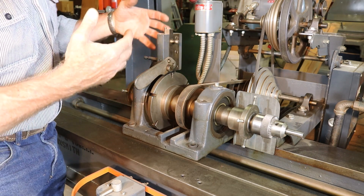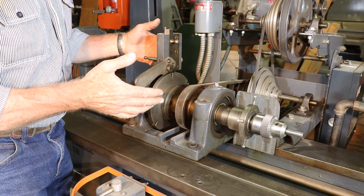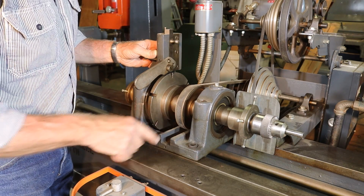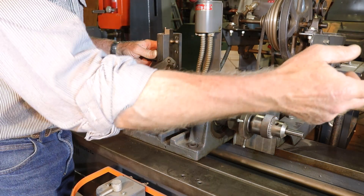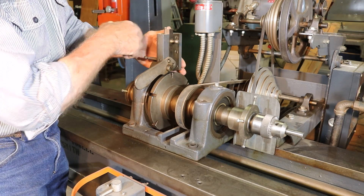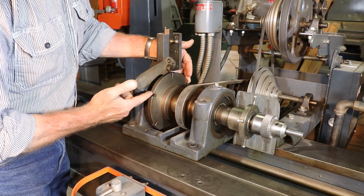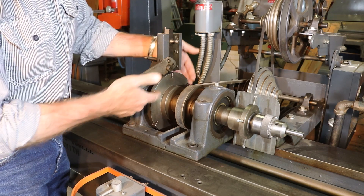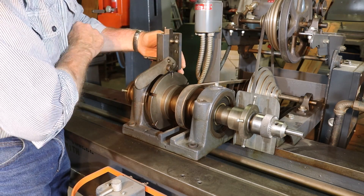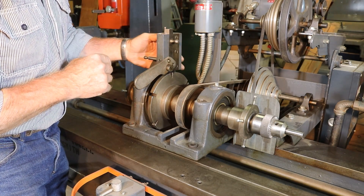When it's rifling only, it would have had an automatic indexing setup with a rack and pinion. That rack gear would run back and forth on a pinion gear, and whenever the rifler went through the barrel, it would index up. You can see these notches in this plate here — there are six of them for six-groove rifling. It would be indexed over a sixth of a turn, locked in, then that cutter would go back through, and it would all happen at the same time.